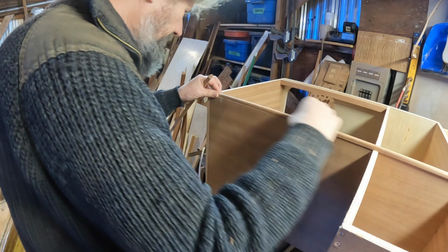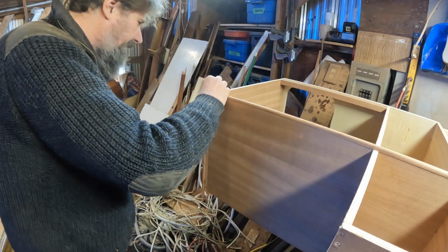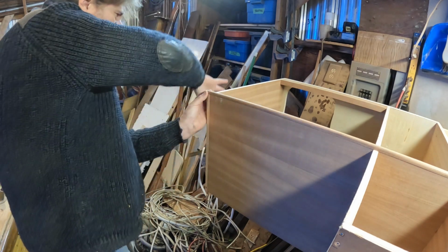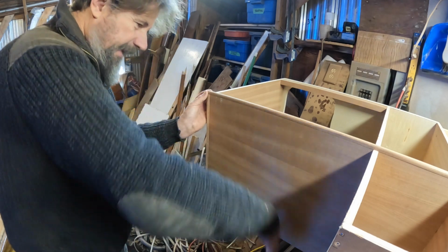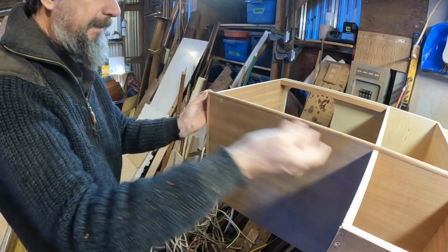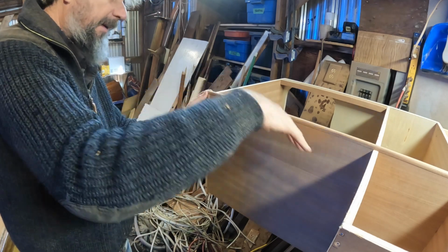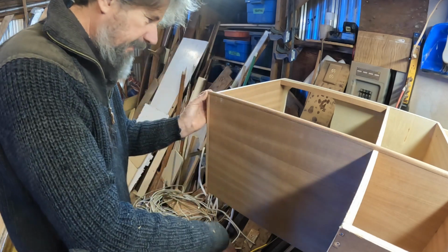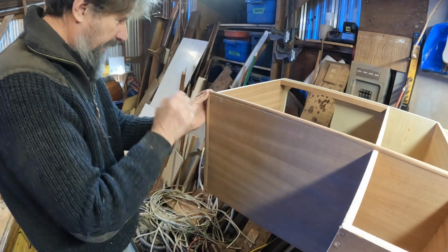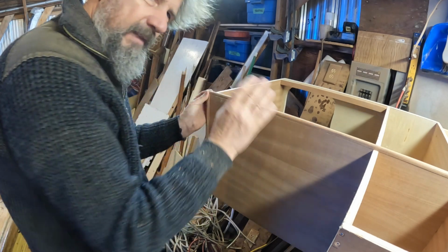All right now, so this band is going to wrap around the corner, and that's for a couple of reasons. One is that there's fasteners out here I need to cover up, and two, I need a way to separate this upper side panel, which is above the engine, and the panel that will be removable. There'll be like a corner panel here that looks like a drawer and a side panel, but there'll basically be one panel that'll come out for access to the little Beta Marine. So that bead on the side here gives me that differentiation between the upper side of the galley and the lower side of the galley. Anyway, you'll see when it all comes.